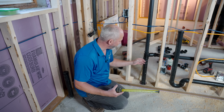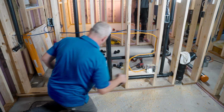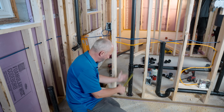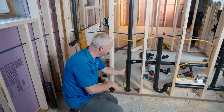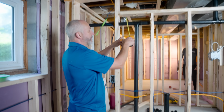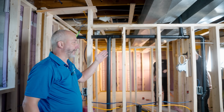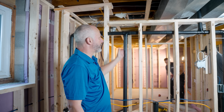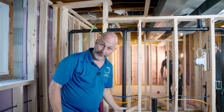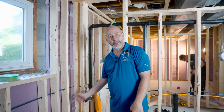So what this does is it brings the water from the drain line here, that elbows out for the sink, and it brings the venting, the fresh air, at the same time. This also provides fresh air for the toilet, to vent the toilet as well. And then this stack is going to go up, it's going to connect. All the fresh air just keeps on connecting, right? And the idea between venting is, whenever there's a connection, if water gets in the line, always connect it so water can flow down. It'll eventually find a drain. Over here is the fresh air vent underneath there, and that'll set the height. For the dog washing station, we'll get to that at a later date.